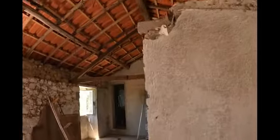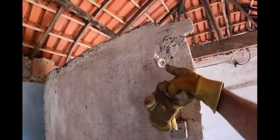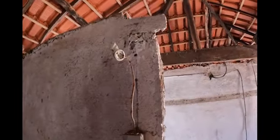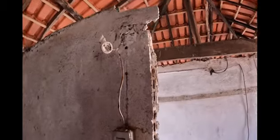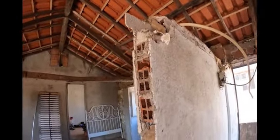So we've got some wire on the outside. That one's going to be pretty straightforward. That's what's powering the lights, and that was a socket, so they must be powering a socket and a light switch off the same thickness cable. I don't think that's legal out here now, mind, this is an old house. So that's going to come down pretty straightforward apart from that, but we've got to work out this.